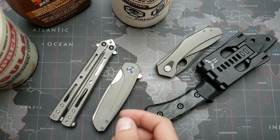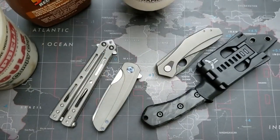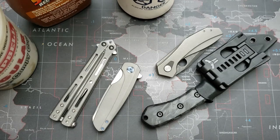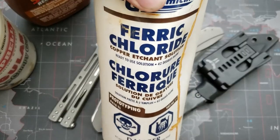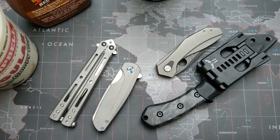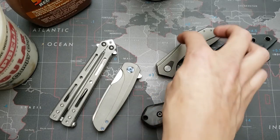On the other hand, this is ferric chloride — the acid stonewash for blades. There are several different types of acid you can use; I think muriatic acid is maybe for carbon steel and whatnot, but I could be speaking out of turn. This is ferric chloride, and this is what I've used. I just throw it in a glass mason jar, and it's pretty much the same deal.